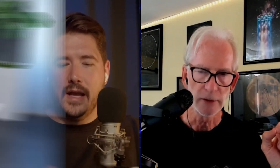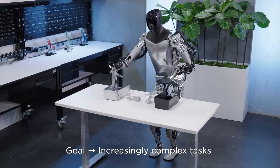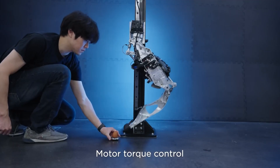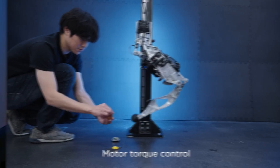What you notice is that the calibration movement is a special programmed adjustment sequence. They know digitally what the position of the hand should be, and if that's off, the camera measurements tell them whether to move it up or adjust the encoders controlling hand movement. Usually you have the robot go through a certain sequence of exercises. Part of it is that you don't want to be too methodical — you actually want to be a little random about those positions to get rid of any biases.